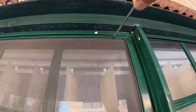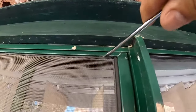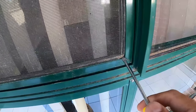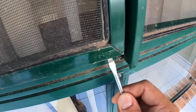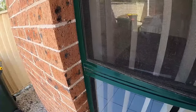I'm using a screwdriver because, as you can tell, it's pretty dirty — it probably hasn't been taken out of this window frame in about 10 years. All the dust and debris basically seals the fly screen in. So I get the screwdriver, put it up against the frame, and lift up — you can see that side went up. Make sure the other side is also up, then come back to the bottom and lift it up a bit more so there's a gap down there. Then use the screwdriver to pry the fly screen out. Now we've got the gap — pull back and that corner is out. These ones have to go in on a little angle, so pull this side out as well, wiggle it, and it'll all slide down.